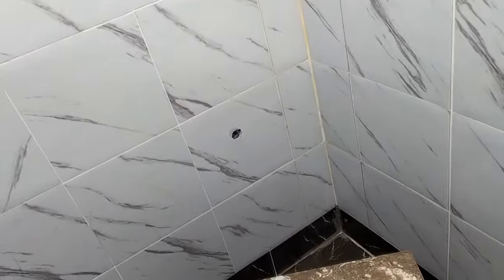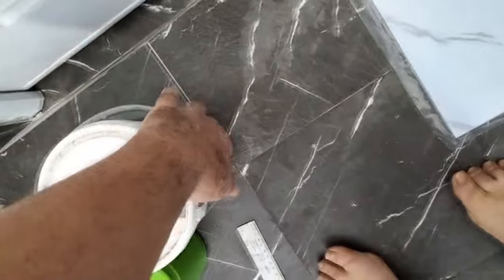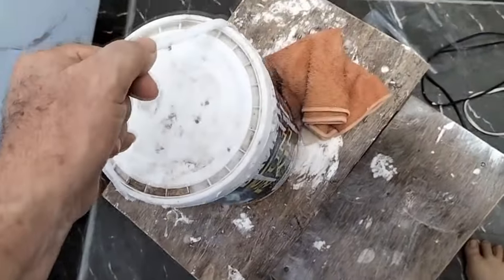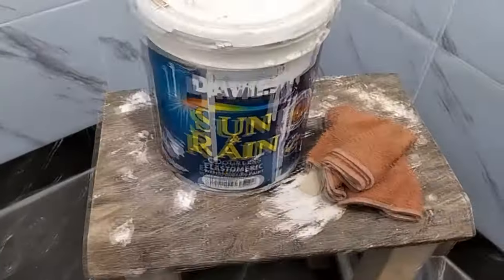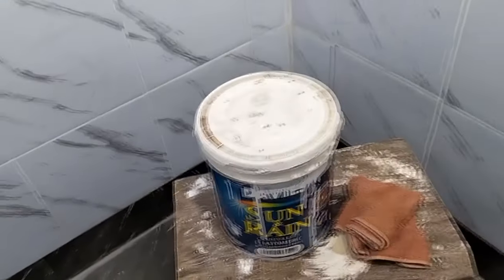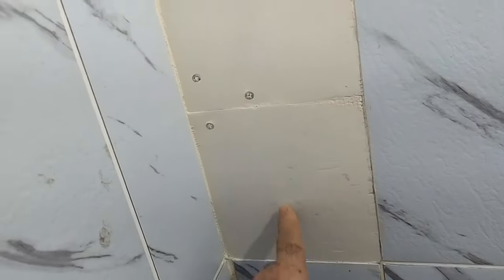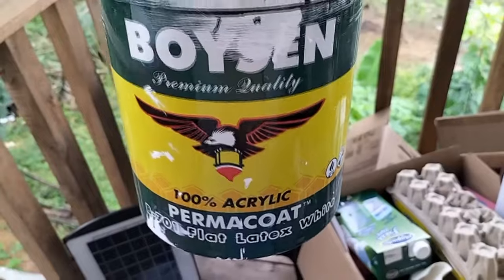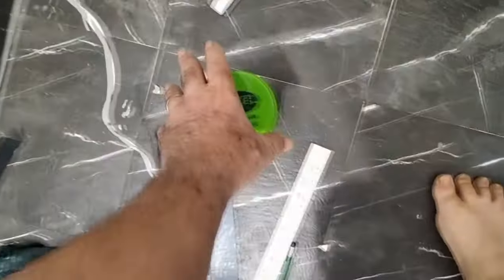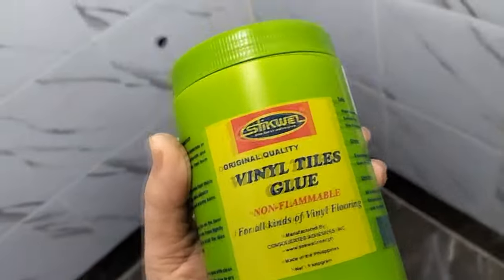Let me take a little while and do this in the background. The paint is important too — that old paint I put before just came off so easily. This is what I suggest strongly: it's a type of latex and it works very well. Now I can stick a tile there, no problem. I just put a little bit of glue — not too much, just a little bit — and I wait maybe between five and ten minutes, let it get a little tacky, and then I put my tile. Since I've done that, it's working really well.